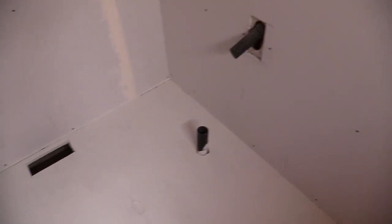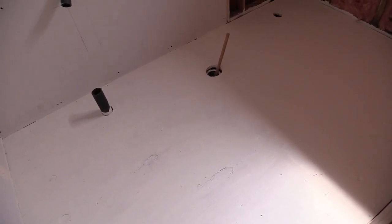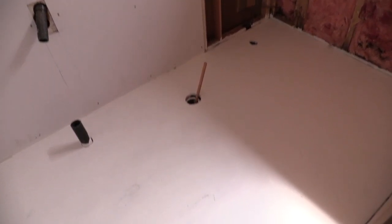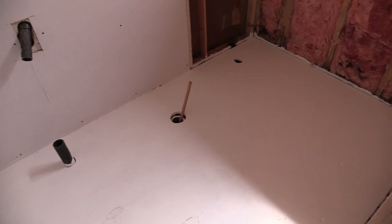I'm probably going to put another access up high. The backside of this is the laundry room. This is all new plywood floor — I had the floor pulled up and had someone else replace it. I went ahead and sealed it with Kilz, put a couple coats on it. On these mobile home floor joists, they're so bad that they end up just taking particle board — like three-quarter inch particle board — and putting them in different places to make up the difference so you can have a halfway level floor.